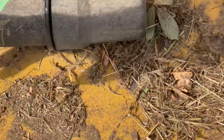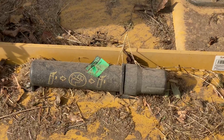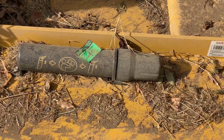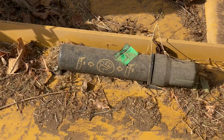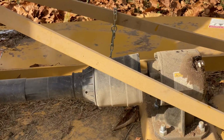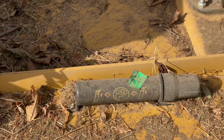This is actually an owner's manual guide and instructions on how to put it together. And I don't recall seeing anything on taking it off. And what I'm gonna do is throw in a couple adjustable wrenches and probably a couple shear pins, maybe a small can of WD-40 if I can get it all in there. That's the most common problem you'll run into out in the field is shearing one of your shear pins. So just having those basic tools to get it up and running out in the field, to not have to come in to the yard to get fixed up is nice.